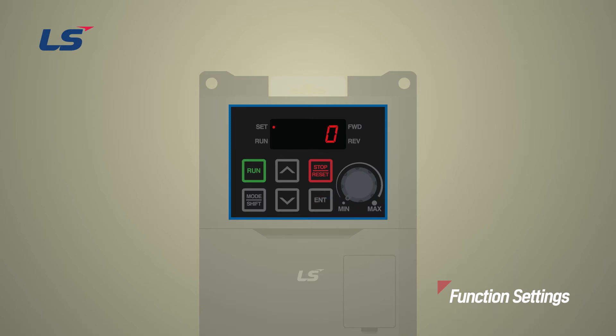Select one DC start in AD7 start mode. When DC start is selected, DC start time AD12 and DC injection level AD13 will appear in the menu. At DC start time AD12, press the Enter key to set the time using the arrow keys. The time setting can be set from 0 to 60 seconds depending on the application. Press the Enter key at DC injection level AD13 and set the amount of DC applied. After setting the level using the arrow keys, press the Enter key to save it. The amount of DC applied can be set from 0% to 200% depending on the application.